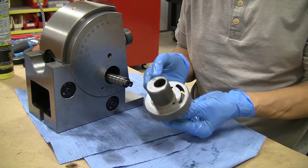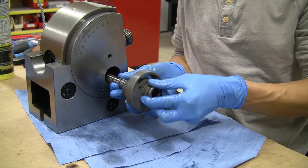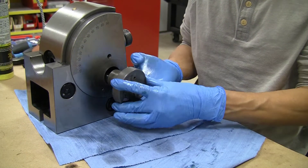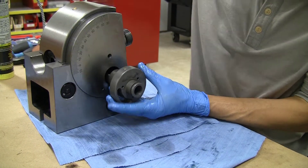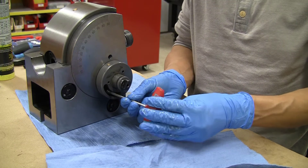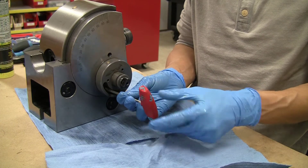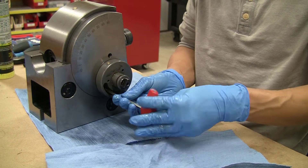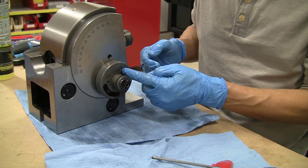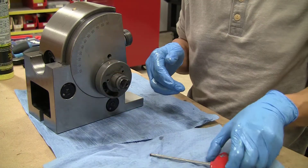There was a ball bearing at the tip of the worm. Now the mounting bracket goes in — it's a very snug fit and it's eccentric, so the hole and the slit have to be positioned downward. Then it will go in very easily — basically it has to be in a disengaged position. This is the one and only screw that holds the engagement between the worm and the gear. Interestingly, the downloaded manual shows a second slot and a second screw along that side, but we have what we have.